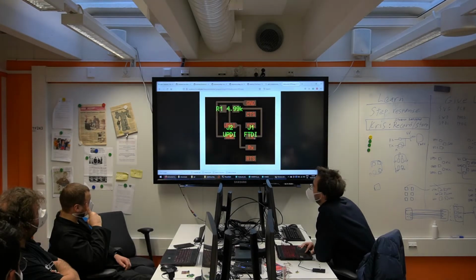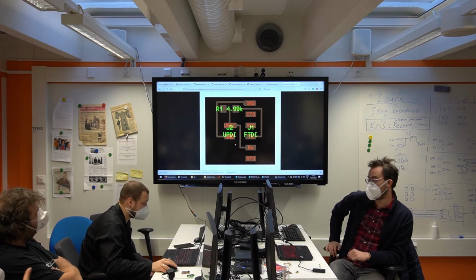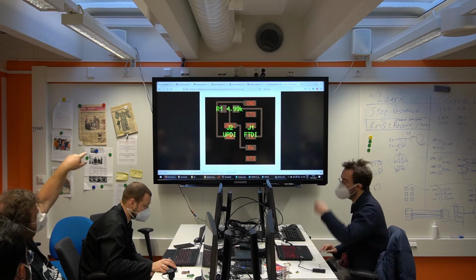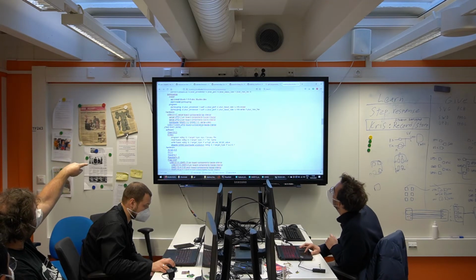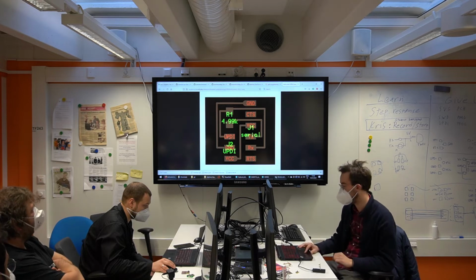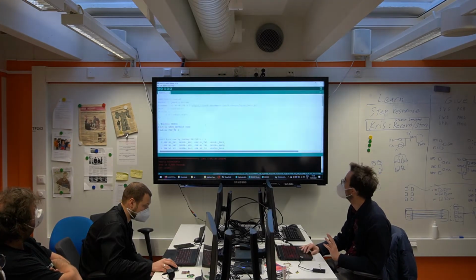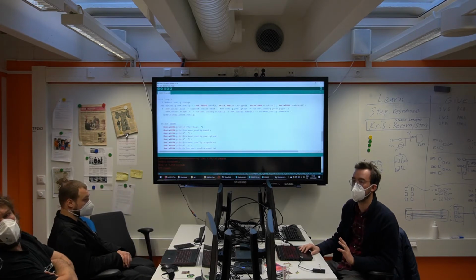Yeah, just add this on top of it. Adrian changed this one and included the VCC trace also last year, I think. Oh yeah. But the Arduino has 3 pins, right? Yes, yeah, that's fine. It was listed there. I think it's also available here. Yeah. Yeah, see, 3 pins. So, in all of those cases, the chip that's actually doing the hard work is the D11C, and you can use my code to have dynamic baud rate changes, which is kind of nifty.